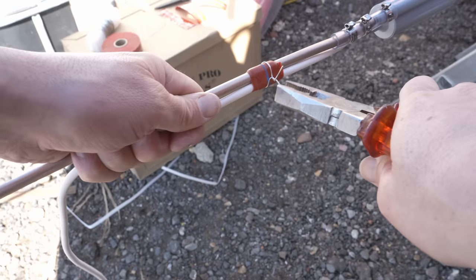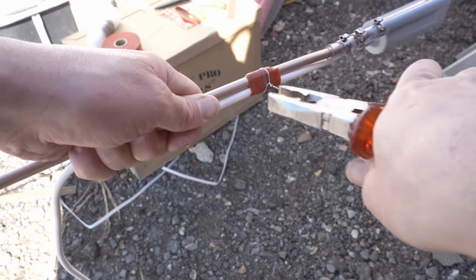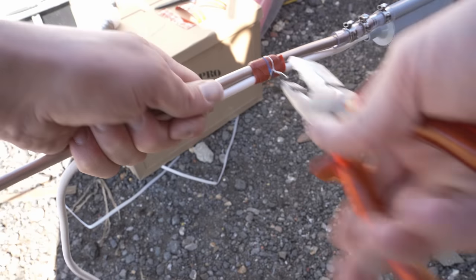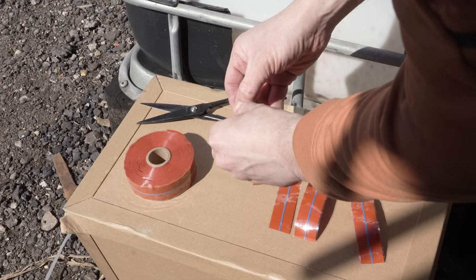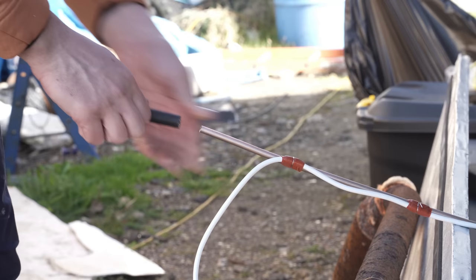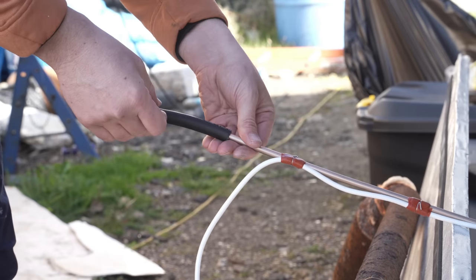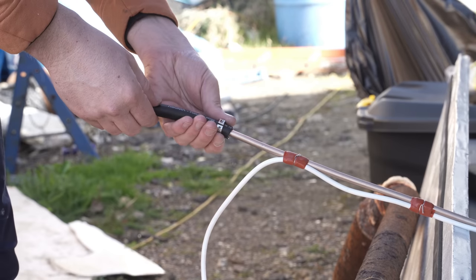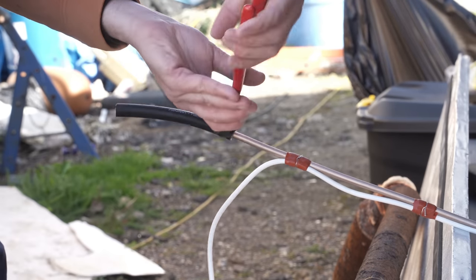This will hold its shape, and should be joyously resistant to corrosion, algae, and other nasties when submerged. I also need to run the pump's inbuilt DC power cable back up and out of the water tank, so I decided to neatly bind them together. To avoid any reactivity with water, disinfectant, and so on, I'm using self-amalgamating silicone wrap, and then a twist of stainless wire to halt any unravelling. The top end of the pipe is not barbed, of course, so I'm trying out the very tightest O-clips possible so we get a good seal when I clamp it all together on board.